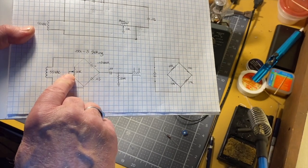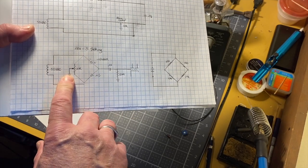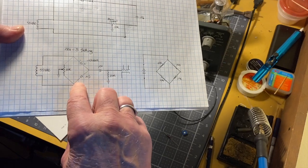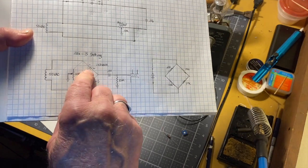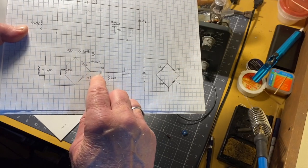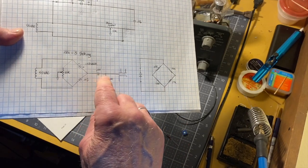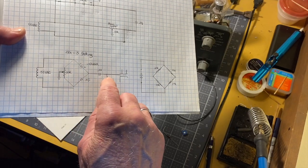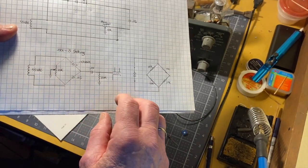They have a potentiometer here that's run to ground on its center tap, or its tap, and so we've got 10K across these 2 legs in essence. Across this leg we have a 0.02 fixed and known good capacitor, and then across this leg, that's where our test capacitor, the one we're testing, goes right there. And then this circuit right here is the magic eye tube. This 0.01 into a 10 megohm resistor gives us a measurement across from the center tap to that point right there. And this is what makes up a bridge circuit.